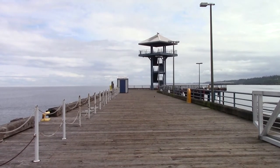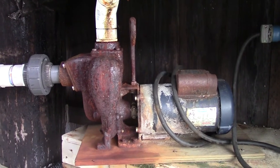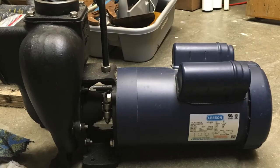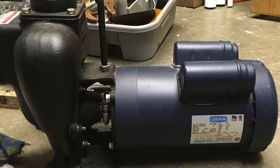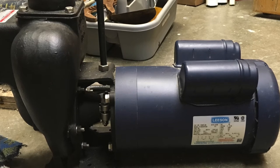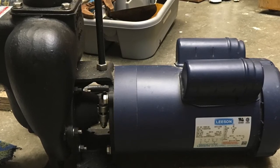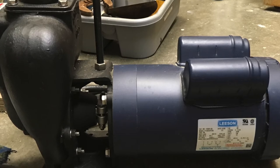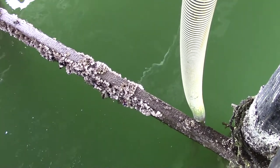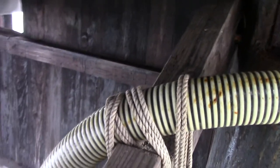The maintenance starts here at City Pier. It is actually underneath this pier where our pump platform is located, and the pump platform is home to the pump, which of course does all the heavy lifting. Believe it or not, this is actually how that pump started out looking like. We use a centrifugal pump, which basically has an impeller that spins to help push or pull the water. The pump is powered by a single-phase 240-volt, 3-horsepower motor and has an RPM of 3,450. Since the motor and the pump are connected via a direct drive, our pump also has an RPM of 3,450 — so there are 3,450 rotations per minute, giving the pump power to pull the water up from about 10 to 20 feet below the water surface.